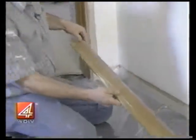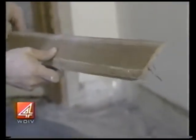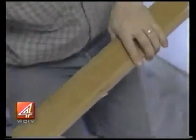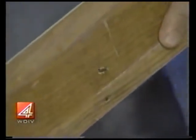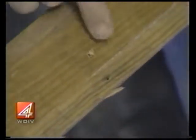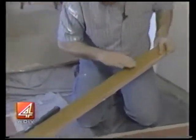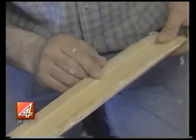Another thing that often happens is when we go to pound the nails out — they've all got nails in them — and when we go to put it back in we can't necessarily use the same nails. A lot of times when we bang these nails out it damages the wood even more. You can see here it's made an even bigger hole; some of them will break really big. When it starts to break through like this and causes more damage to the face of the molding, we simply pull the finished nails through from the back.